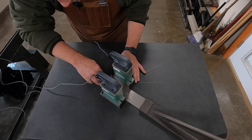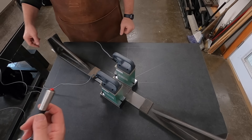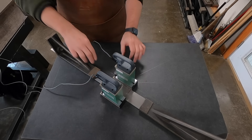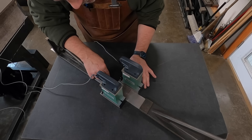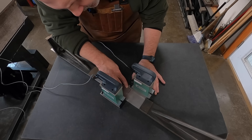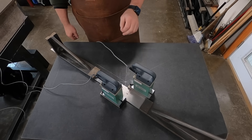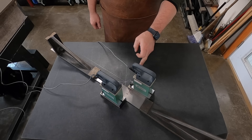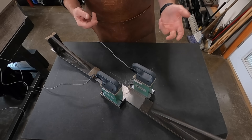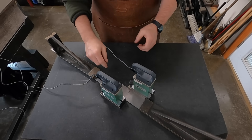I'm giving Lance a hand — we've got this little button right here and this is used to record the measurement. You're moving every four inches, correct? Yeah, the critical part about the electronic levels is the back foot needs to reside in the same place that the front foot resided in the prior measurement. That's the most critical thing — you want that consistent overlap of four inches.